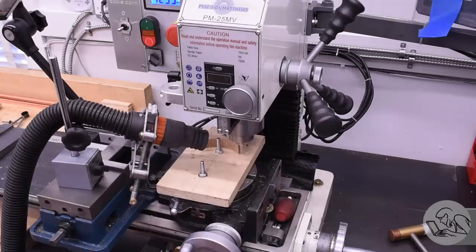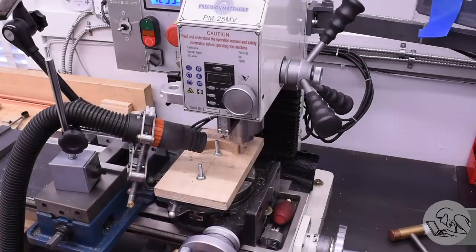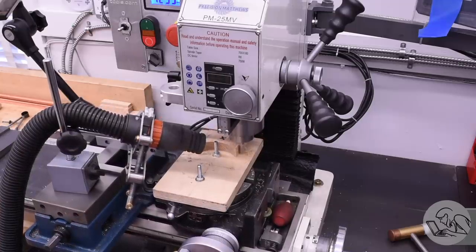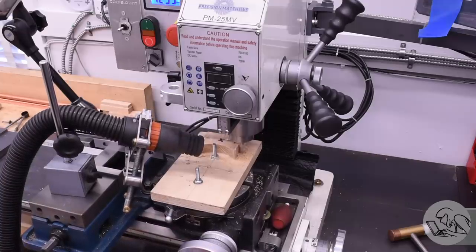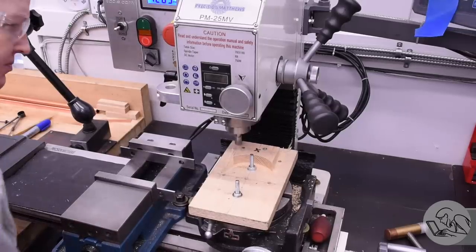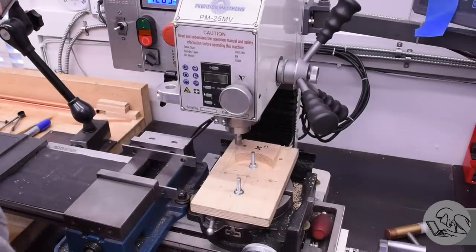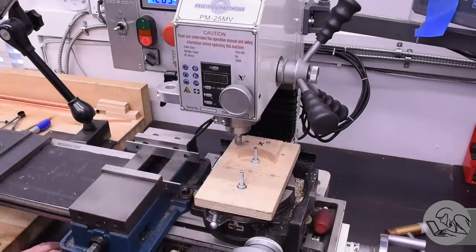This former also has a critical dimension left to right, and I can again easily cut that here in the same setup just by side milling down to size, and then once again putting the correct corner radii on there. I think I made it look pretty easy here, but it took me quite a bit of figuring to land on making that fixture plate and doing all the correct prep work with all of the references and everything. I hope that made sense, and if you're doing this, definitely do something similar.